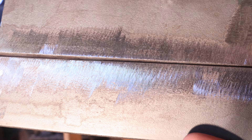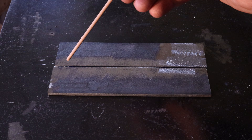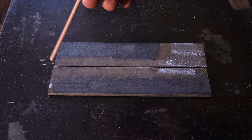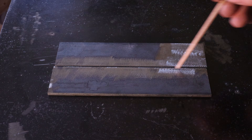For both of these electrodes I'm going to weld a butt joint on two 8 inch long pieces of steel, and I've ground down both plates where the weld is going to happen. With 6013, when I was testing I found that it was easier to go in a swirling motion instead of pulling straight across — it made the weld adhere a little bit better to both plates — but to give a control I'm just going to pull them both straight across the weld.